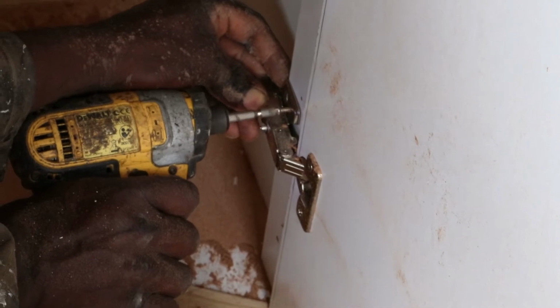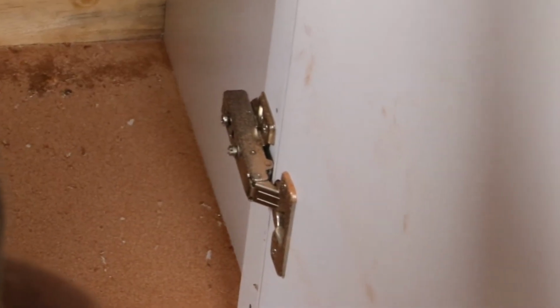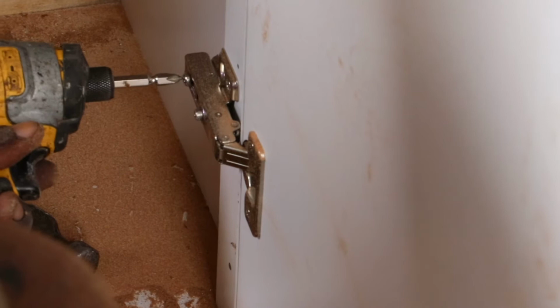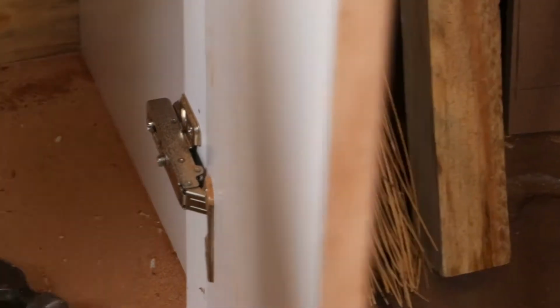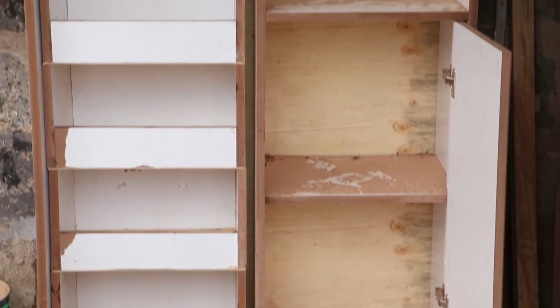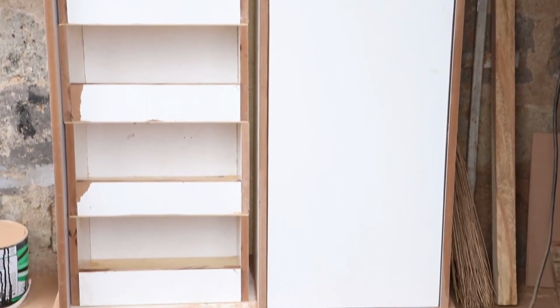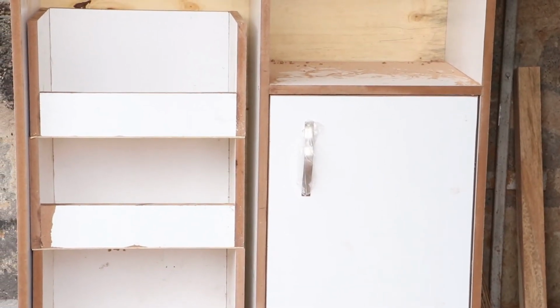Since the door was perfectly fitting on the inside, we added a strip of MDF at one edge so that the adjustable part of the Malfa hinges can be attached on it. We did some adjustments on the top and bottom, and the door was perfect to go. We later added a chrome handle to the door to complete it.